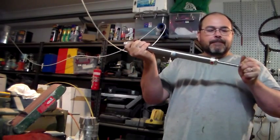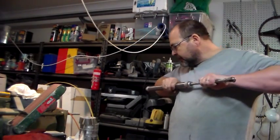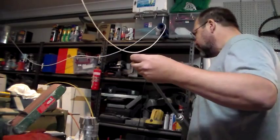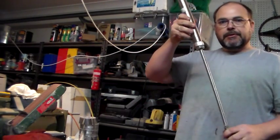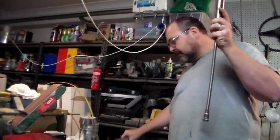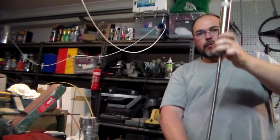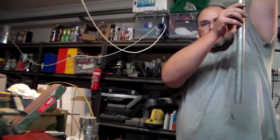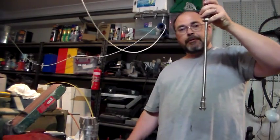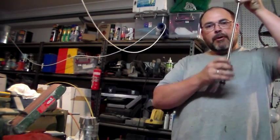The stroke obviously refers to how far the ram comes out — so this is your stroke. This one has quite a long stroke, as you can see. You've got to imagine having this mounted here, and then attached to the end there's going to be a piston which I'll be making out of this piece of galvanized pipe — so that's quite a long injection nozzle mounted to the front of the machine. If you went for something with a shorter stroke you could get the same capacity by having a larger diameter pipe for the injection module.